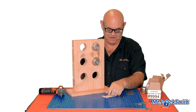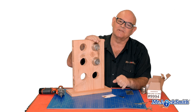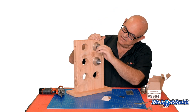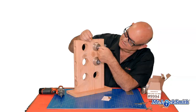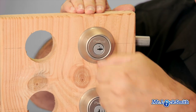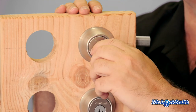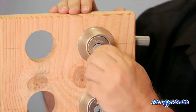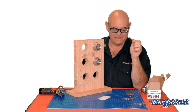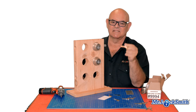Now let's try something a little different — first time trying this, doing it right on camera. I cut a Schlage key: 6-9-7-6-8, which is not within the tolerances. This thing can only go from one to six, but I've got a 6-9-7-6-8. Let's say the customer's got a key and I want to fit this lock to it. I put it in with the slot to the top. I don't hear anything, but the key comes out. Here is an SC1 key — I've gone outside the one-to-six range they recommend with a 6-9-7-6-8.